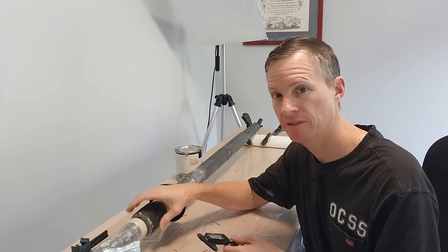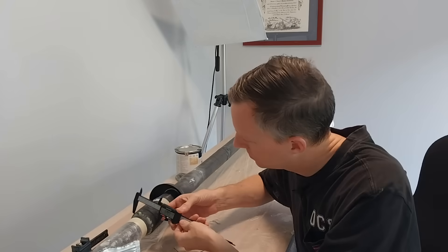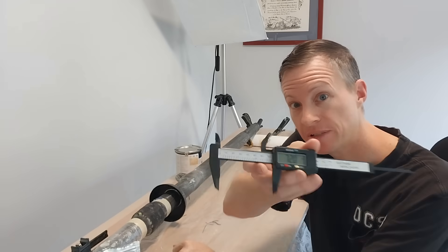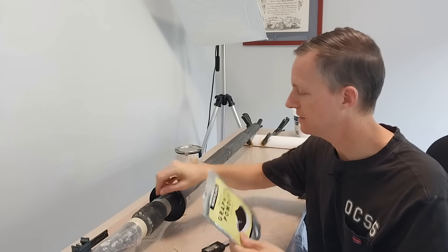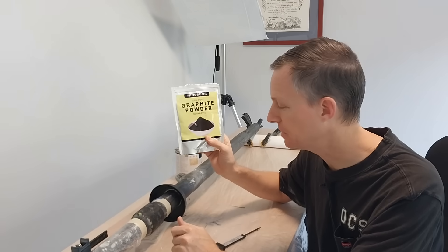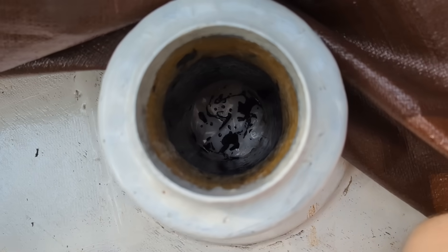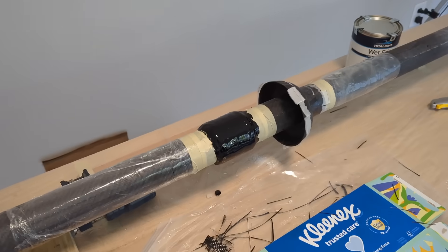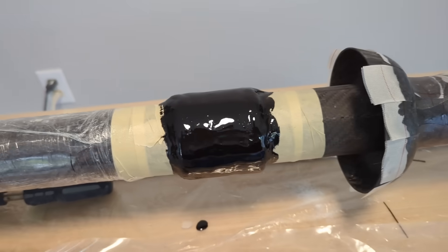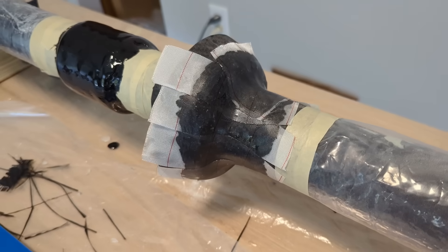Let's check the width — the maximum I could have was 74 millimeters and still have room for spinning. I came up with 72 millimeters, which is perfect. That'll allow space to add a layer of graphite powder mixed with epoxy, and that should spin very smoothly. I've applied the graphite-mixed epoxy inside the mast tube where it meets the bearing, and the graphite layer is on the bearing itself. The rain diverter is carbon fibered on with a nice fillet and two little layers of carbon fiber.